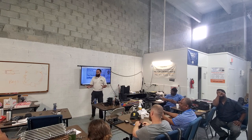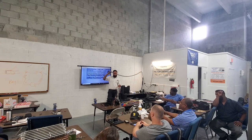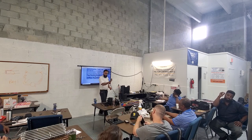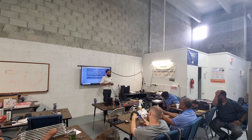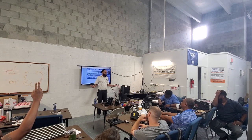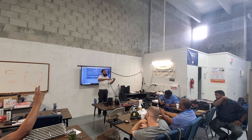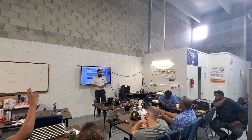Do you understand why? Because before we vacuum, we're at zero PSI. It's not plus and it's not minus. It's neutral. It's like this guy in the middle, he doesn't choose right or left. So when we vacuum, it goes down into the negative, but it doesn't want to stay negative. That's not normal. It wants to stay at zero. So if there's a hole, air starts coming in, bringing that negative back up to zero. So it has to remain in that vacuum, in inches of mercury.